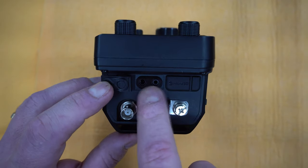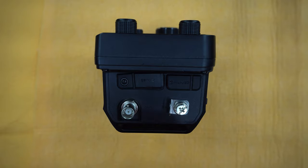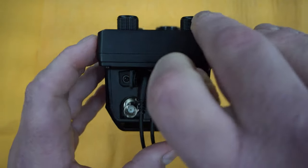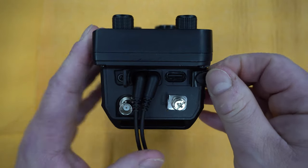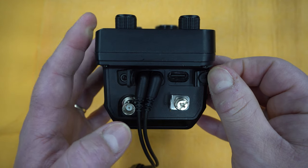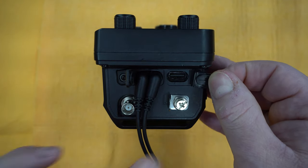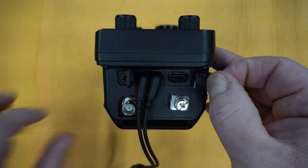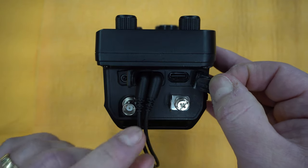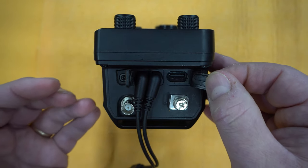Here you have the microphone input. For the audio, you have the speaker and the mic. The speaker is a 3.5 millimeter common plug and then you have the 2.5mm for the mic. Right beside there, you have the micro SD card where you can save your configs, save your repeaters list, download from the ICOM website to find with GPS coordinates the nearest DSTAR repeater near you, do firmware upgrades, and many things. But the main thing is that you can record your QSOs with the timestamp, date, modes, and frequency. So you can actually do the logging after your event when you go out in the field. I used that in a previous video to save the QSO, using the audio saved internally into the radio instead of my camera audio.